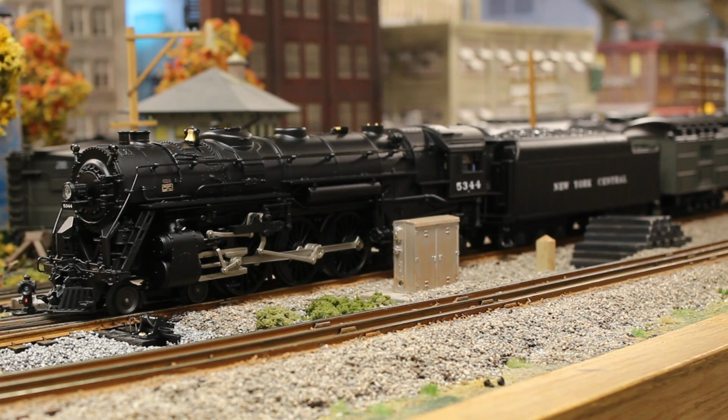A friend of mine had given me a K-line Cruise Command upgrade kit, which was designed for the Mikados and these Hudsons. I went through the whole process of installing it, and unfortunately it did not yield the results that I was after. I did get better low-speed control, but for some reason it wasn't taking programming. I tried to adjust the motor, like program the motor size or program the speed steps. It was not taking programming commands, even after all the resets that I tried doing.